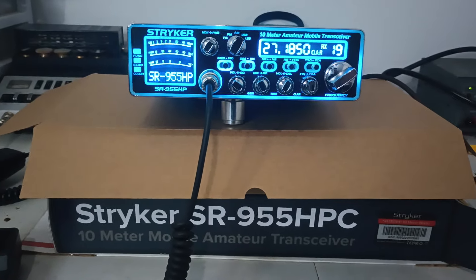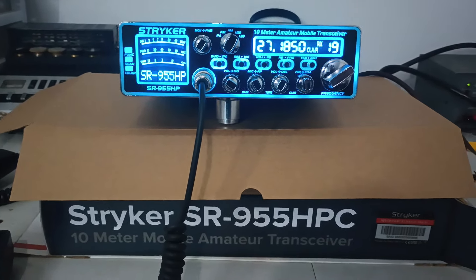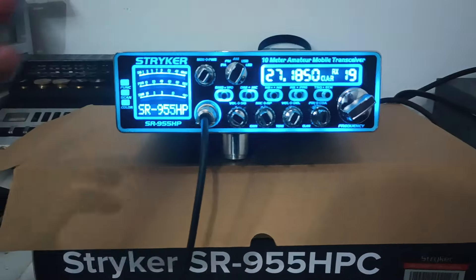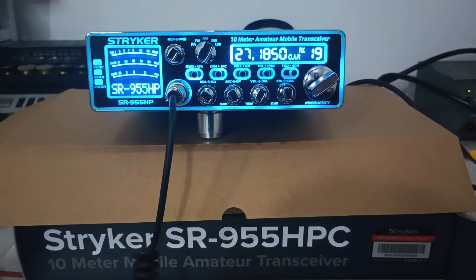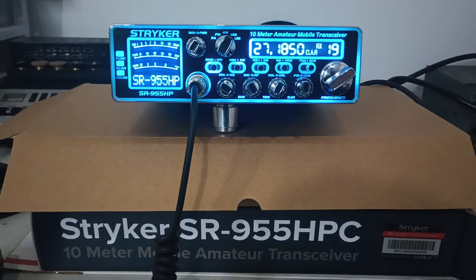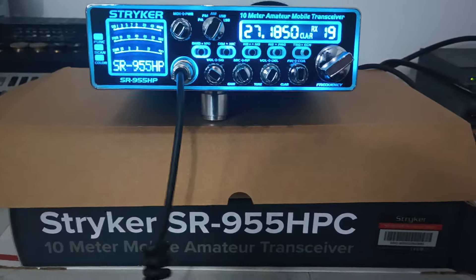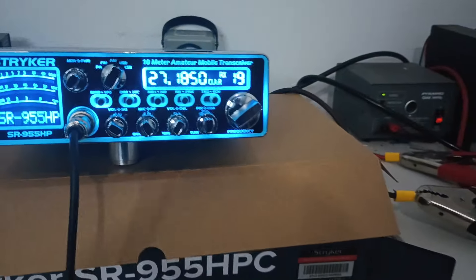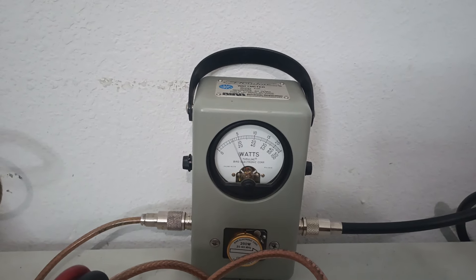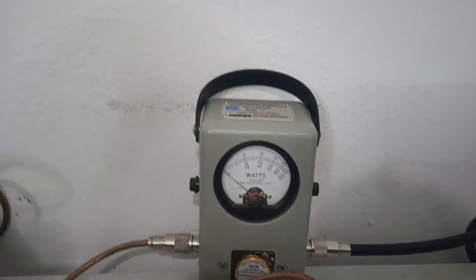I generally write down the settings for every radio, so if one comes back here and it's haywire, I'm probably going to know that you've been in there doing something wild with it. So we'll start with RF power wide open. This is one of the things I talk about with upgrades — they can start running away on sideband, oscillating, trying to throw a carrier, if you don't readjust and recalibrate them in the menu. 250-watt slug: about 60 or 70 watts average.